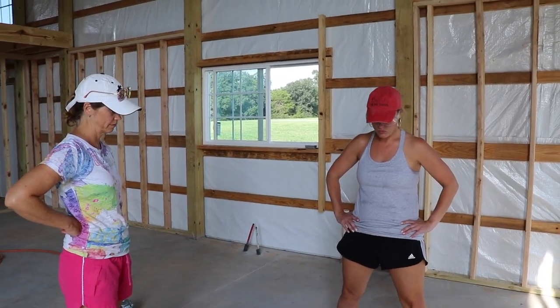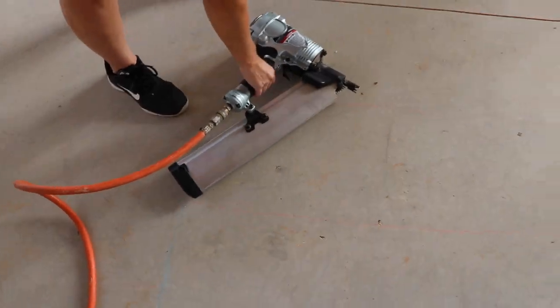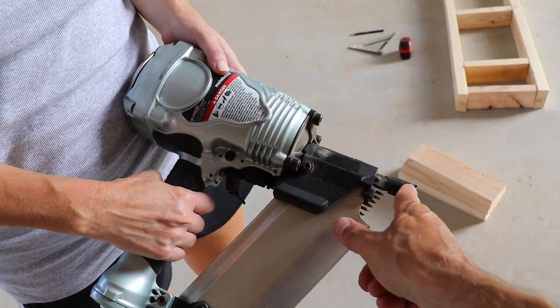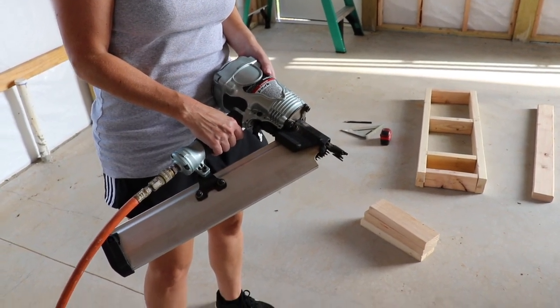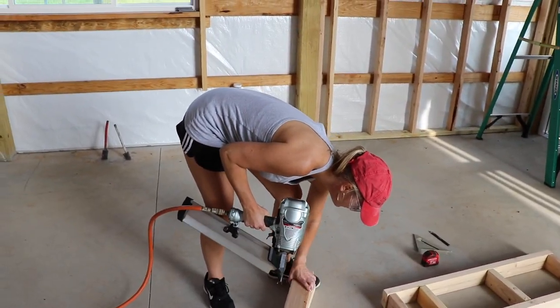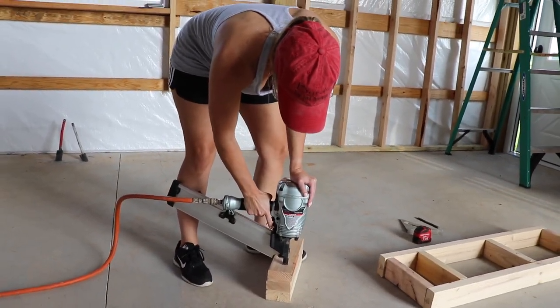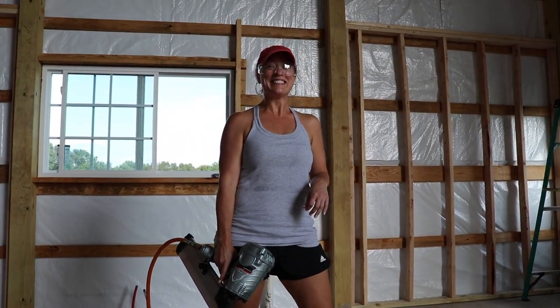Okay, so now let's get the nail gun. Have you ever shot a nail gun before? I feel like I have but I can't tell you. Should we do a practice shot? Yes, in a pile of wood? Yes. Okay, let's go get that set. There's the nail gun — go ahead and pick that up. So the plunger is this piece right here — this moves in and out. When you press it down, it won't fire unless that plunger is pushed all the way back. You got your safety glasses on? Good. And then you push the plunger down and pull the trigger. Woo!